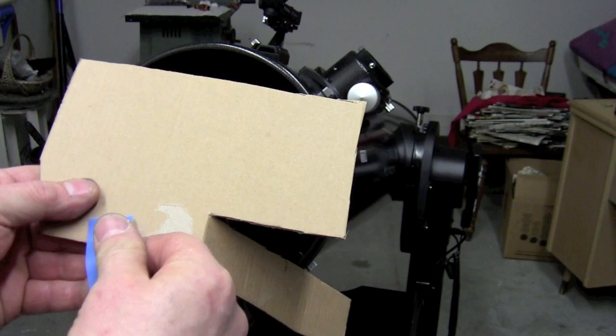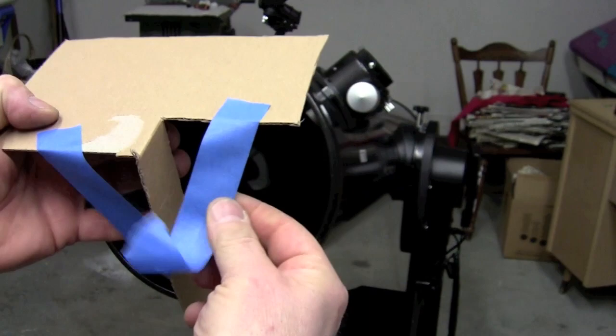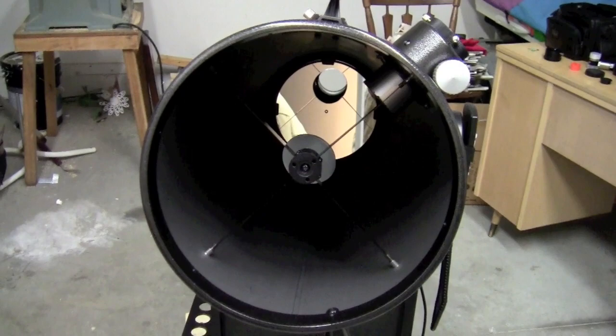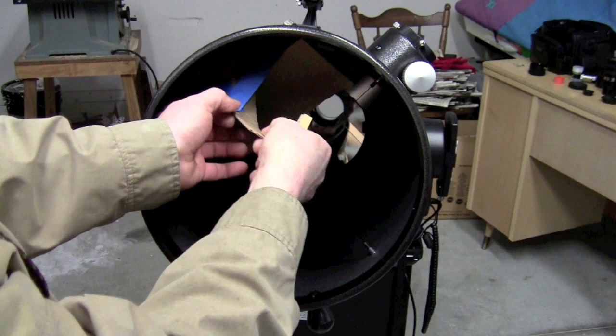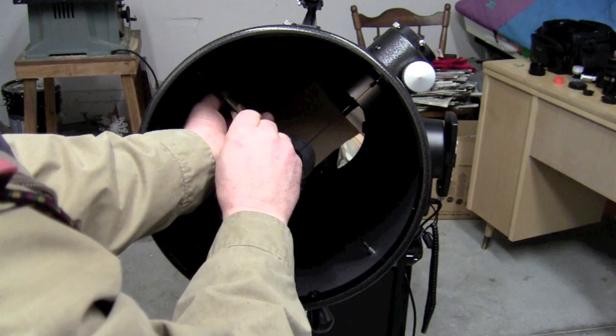This is just a quick way of doing it: just cut yourself a square with that on the side, put a little piece of tape on an angle down so that this will stay at 90 degrees — just that quick. Now it won't flop back and forth. To install it, this will block the reflection — just slide that in and make sure you can't see it when you look through your eyepiece either way.